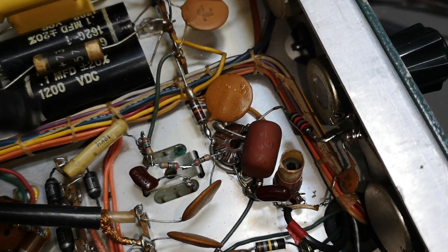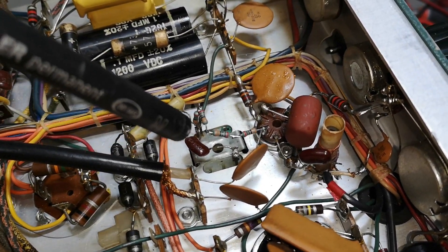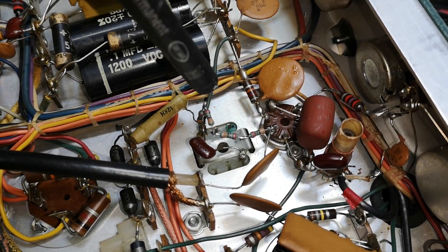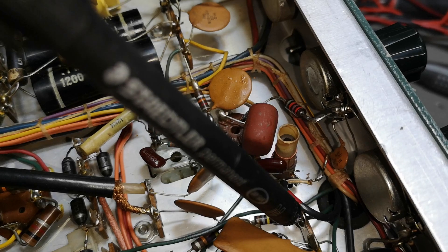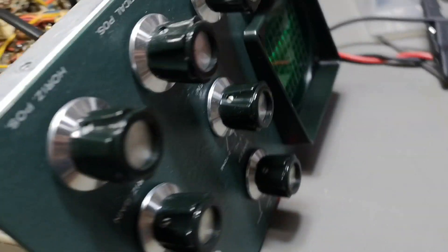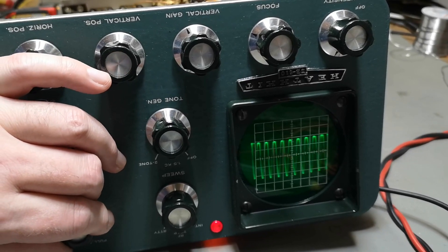What you see here is the vertical amplifier tube. It was coupled for 1.4 MHz input and output frequencies, but as shown in the schematic it can also be wired as a wideband amplifier. I've done that here, with 15 kilohms to the anode supply and an output capacitor. The schematic mentions a direct connection from the input to the vertical pot, but I left the capacitor in and it works differently — let's look.